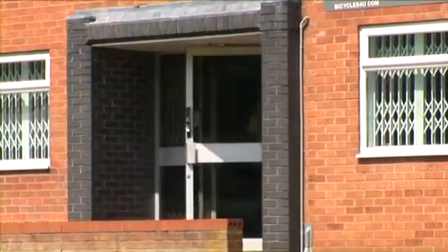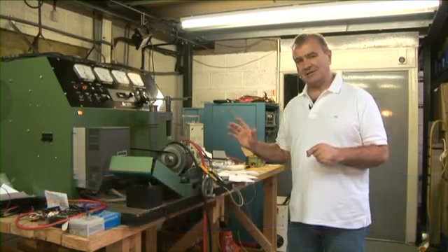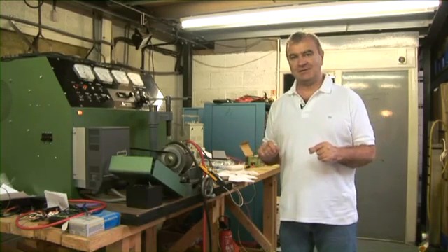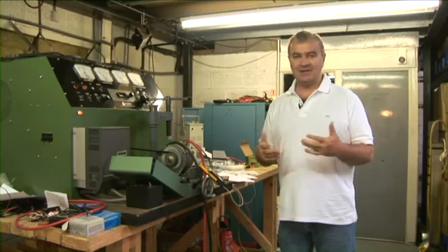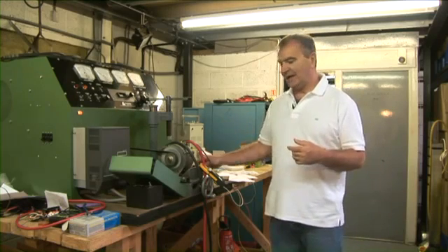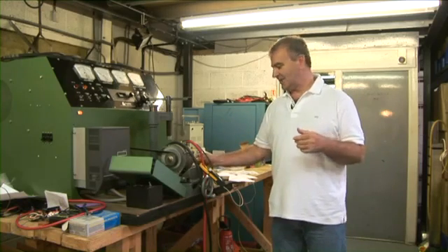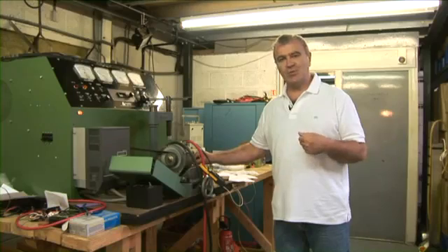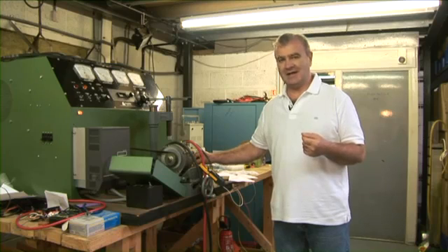This is a typical example of a boat cruising up a river at a standard speed. From this alternator, at present, we are producing 13.8 amps. Now, if you do a 5 hour journey, that's only going to be about 75 amps charging. However, by simply adding an enhanced charging system, the same alternator is now producing 108 amps.